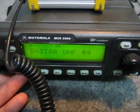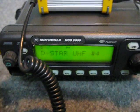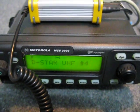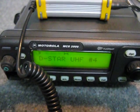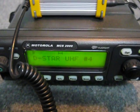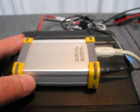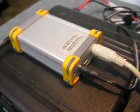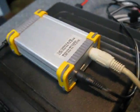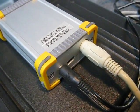You might have seen the video I've got with these radios up at the VK5REX D-Star repeater site — these work very well with D-Star, with GMSK, and I've got this one set up with some simplex frequencies and also the repeater frequency for VK5REX. The DV repeater board is in its case; this is the end with the radio connection and DC in. It's actually operating stand-alone with no computer attached, so nothing in the micro or mini USB connection.